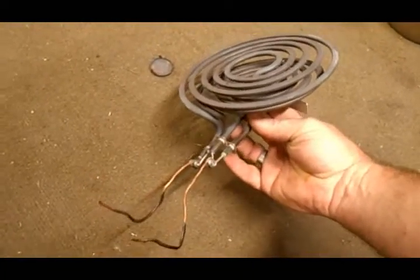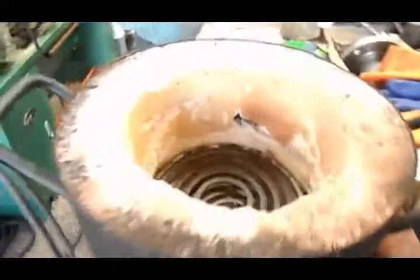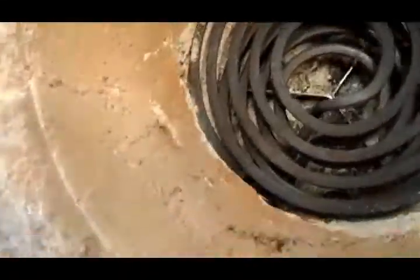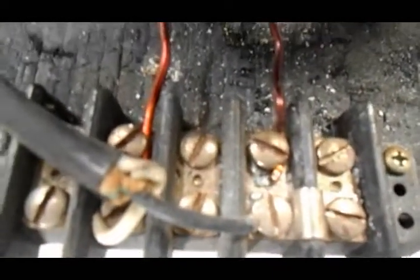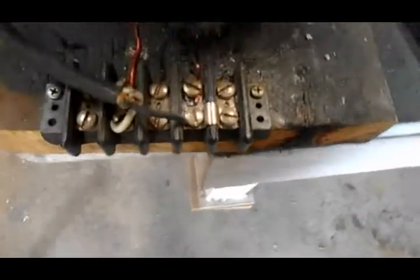I'm going to install it into the kiln and fire it up. I just stuck the burners down in through here — they go down through the hole, they come out right here. You want to make sure they don't touch the metal. Then I screwed them to the bus bar and hooked the plug up to a 220 source that just uses the two leads on the plug.